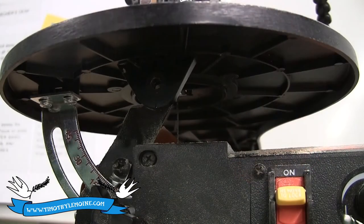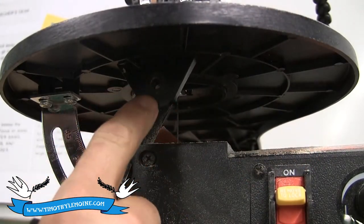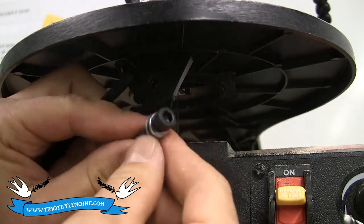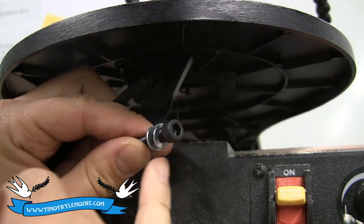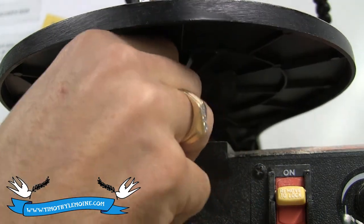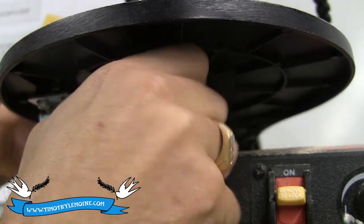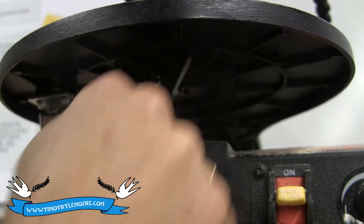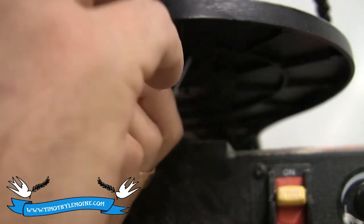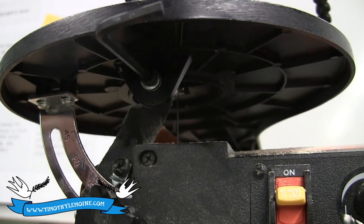Look for descriptions down below so you know exactly what size to buy. All I'm doing is going underneath the front of the table — here is the spot, it's going to be threaded back here. Make sure you check the links at the bottom of this page in the description to get the right thread pitch — it's metric. I'm just going with my cap screw, a lock washer so it doesn't vibrate loose again, and then just a standard washer in there. All you're doing is putting this thing in and snugging it up. Never over-tighten these — the metal in these can be soft, and remember it's about an $85 saw. Over-tightening is most likely to strip things out. All I'm doing is literally just snugging up this particular piece.